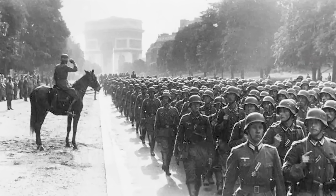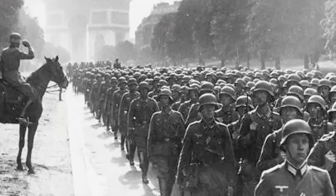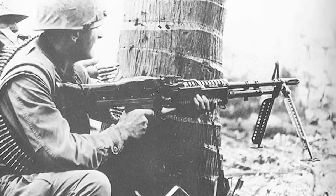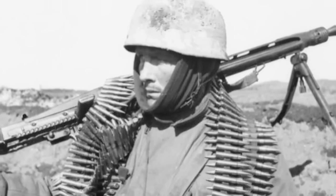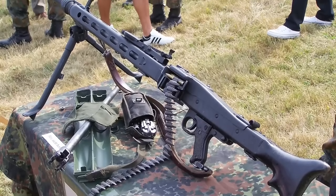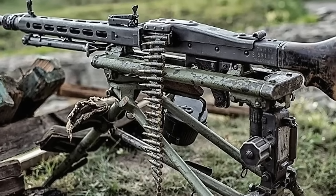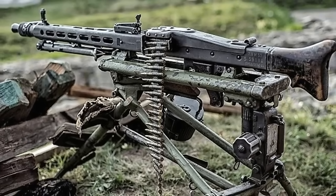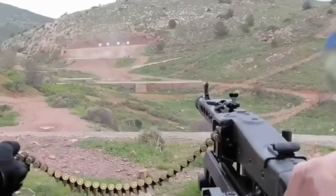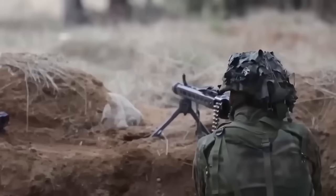And here's the twist. In the early 1950s, West Germany was getting re-armed under NATO and they needed a general-purpose machine gun again. Out of all the designs available, including shiny new ones from the US and Britain, the most effective option was something they already knew very well. So they took the wartime MG42, changed the calibre to fire NATO's standard 7.62×51mm round, tweaked the feed mechanism and the barrel a bit, and called it the MG3. And yes, it's still being used today — that's more than 80 years of continuous service. The Yugoslav M53 was nearly an exact copy of the wartime MG42 and it stayed in service well into the 1990s. The modern MG3 fires a little slower, usually around 1,000 rounds per minute, and the rate of fire can be changed by swapping out bolts of different weight. But the fact that this thing is still in service, still reliable and still deadly after all these years, says more than any flashy nickname ever could.